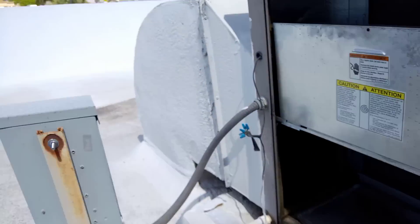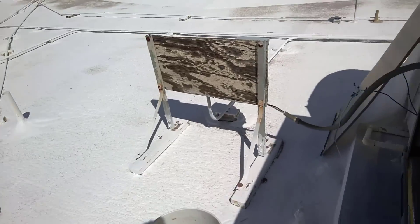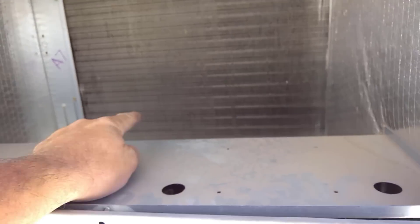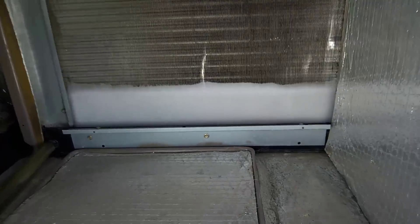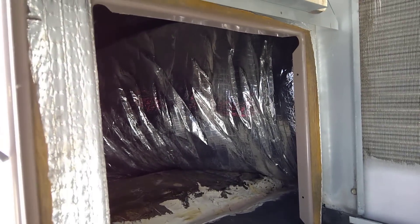That's probably why the unit I'm checking out over here was iced up. I put it over to heat for a few minutes to hopefully thaw out the coil — and it did. There was a lot of frost from the top down. Hope they like the heat! I still got a little bit of frost right there. Same thing with the supply duct — how much air do you think that's being drawn around that flex duct?